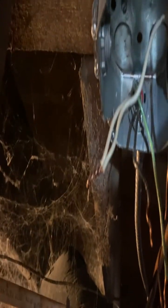Now that we know the power coming in is good, I'm just going to connect everything up — ground to ground, hot to hot, and neutral to neutral — and that should make a nice circuit with the furnace and hopefully the furnace works. A good electrician would do this a lot better than me, but I'm just using these pinch pliers to twist the wires on themselves, putting the wire nut on. We've got three twisted wires here and I'm just putting the nuts on. Got the nuts on.